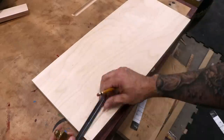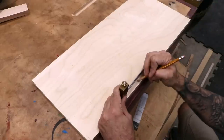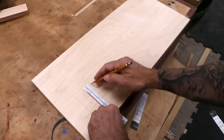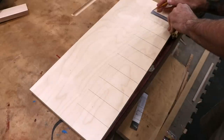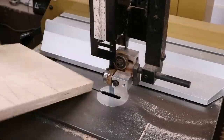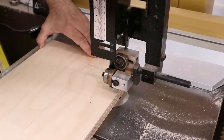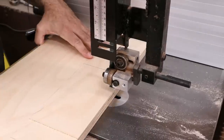Now for the drill slots on the bottom shelf. My measurements are based on Milwaukee drills, so you might want to test this layout if you have a different brand. I found a two-inch spacing works well with two inches between the drills. Keep in mind that a quarter inch on each end goes into a dado, so start your layout a quarter inch in from the ends. The bandsaw works pretty well for these stopped cuts — with a fence set for each position, I could flip the workpiece and make the cut on the other end. If you don't have a bandsaw, a jigsaw will work just fine; just be sure to use a fine-toothed blade with lots of teeth to avoid excessive tear-out.